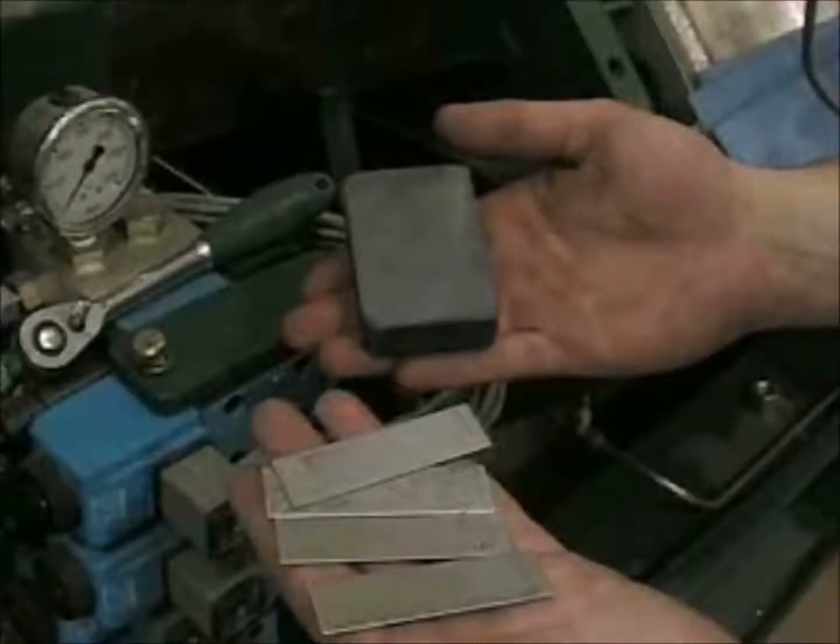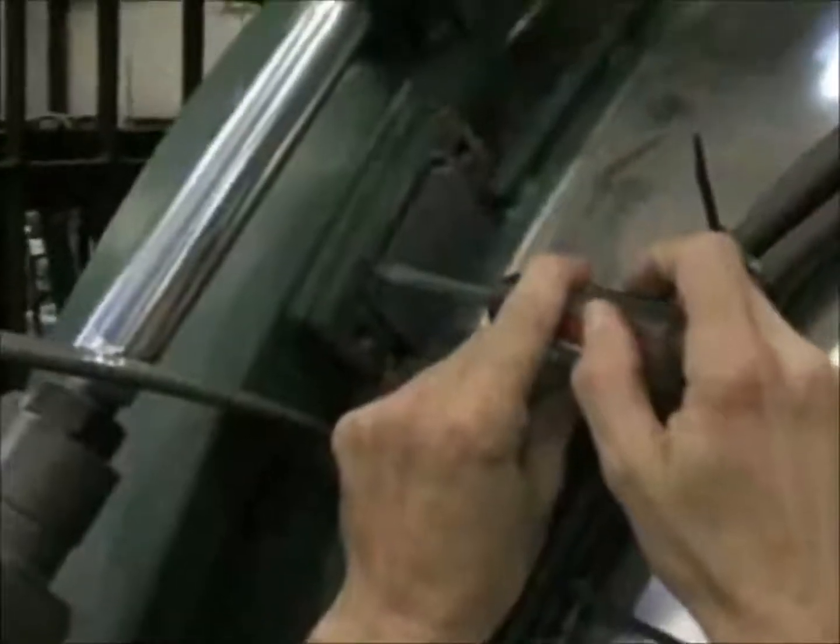Using the same glide blocks and the same shims, same number of shims, that we took out of each glide block holder, we placed the glide blocks back in their holders. A pry bar helps to lift the ring to get the glide block in place.